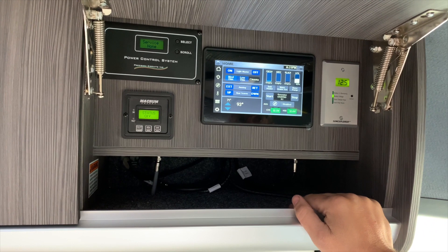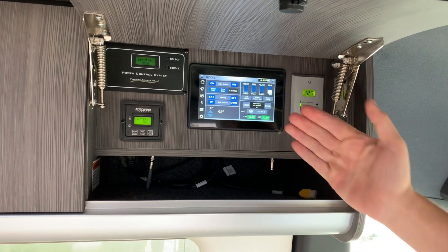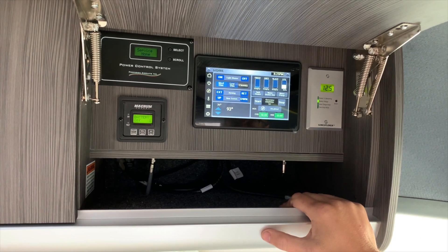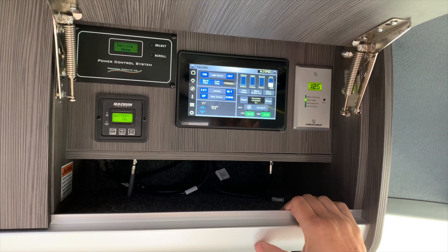The next stage is our battery voltage — I'm showing 12.5 volts currently. We never want to draw this down below 50%, because drawing below that level would deplete the battery so far that it takes cycle lives out and shortens the battery's long-term life.